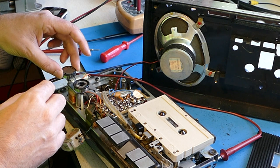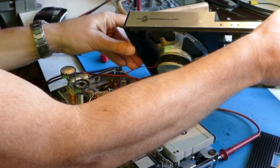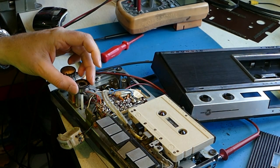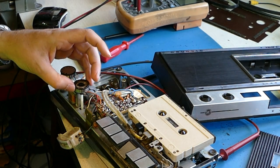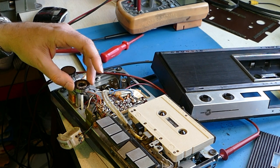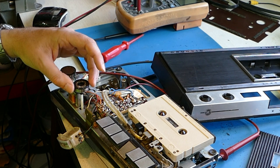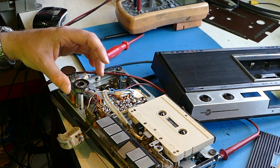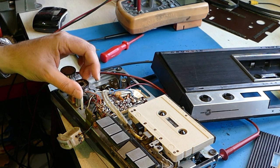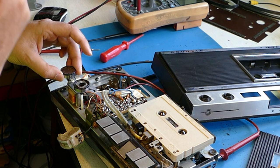It is playing now, but the volume control is very crackly. This control here is tone, and it works the opposite way around to what you'd expect — so turning it up turns the treble down, turning it down turns the treble up. And then you can switch your sound off with the treble control. Well, why not? It's Grundig. Weird. Now it's distorted — listen.